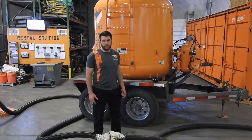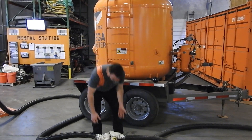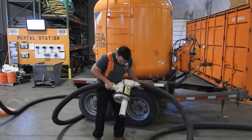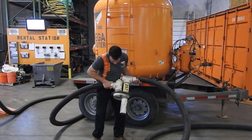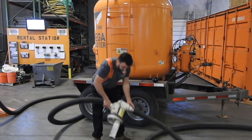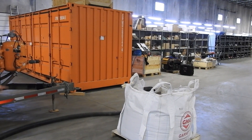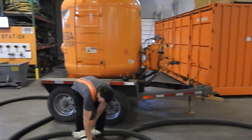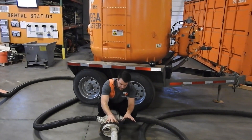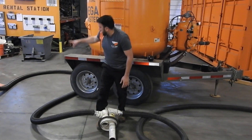My name is Vince Bazaar, I'm the shop lead here at Blast One. Today we're going to go over how to vacuum load a blast pot. We're going to be using this tool here, which is a dropout lid to the top of the abrasive loading port from the mega. How it works is your hose comes in from your bulk bag to load through the dropout. It comes out of the long tube with abrasive and air. The abrasive then falls to fill the blast pot, where dust and air come back out and into the vacuum.